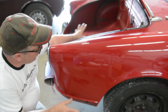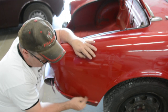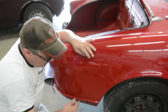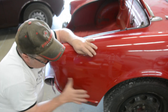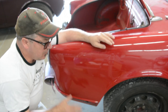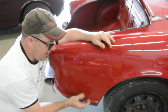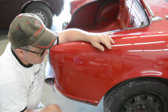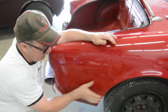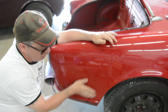Wrapping up what happened here: when we changed up the floor, the seam sealer right here inside the floor was actually holding up against the metal behind the bumper. What we didn't see originally was there was substantial rust right here that came all the way through. So we had to cut that out, put in new metal, and then paint this area. This is a 50-plus-year-old paint job — it's very difficult to exactly match 50-year-old paint because you have to compensate for oxidation over the years and the pigments used today are not the same as years ago. We were able to do a really good blend — right here is a haze line where the fresh paint meets the old paint. We'll come back and feather this out with 1500–2000 grit sanding, polish it out, and you'll never know this happened.